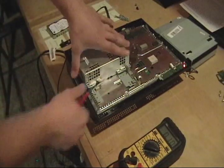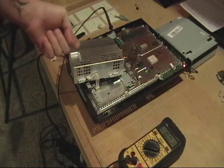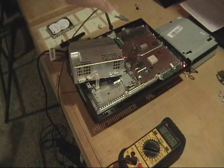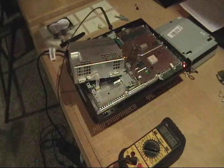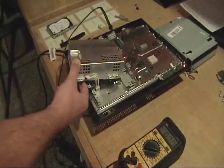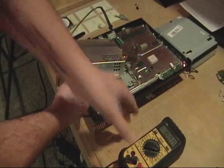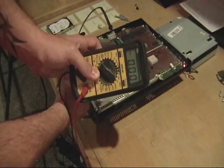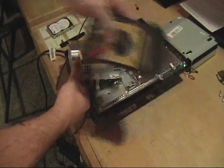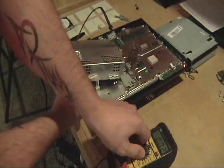And then I always test the power supply as well. You just pop it off. You're looking at the far right hole here. You gotta stick your black and touch it to metal so it's grounded. And I stick my red prong positive in the far hole, and I'm trying to get 12 volts. So I know the power supply is good. So I wanted to show you that.